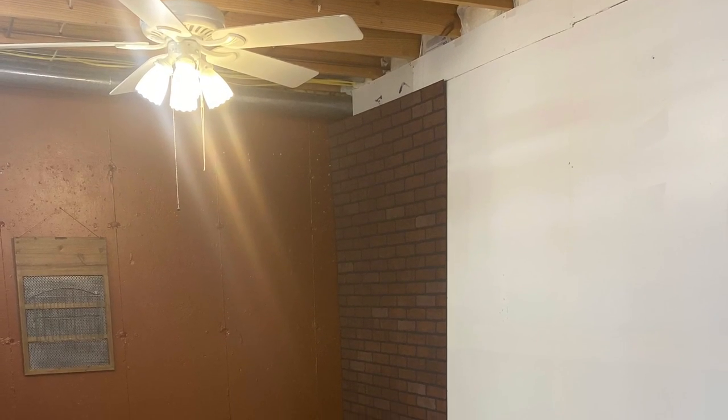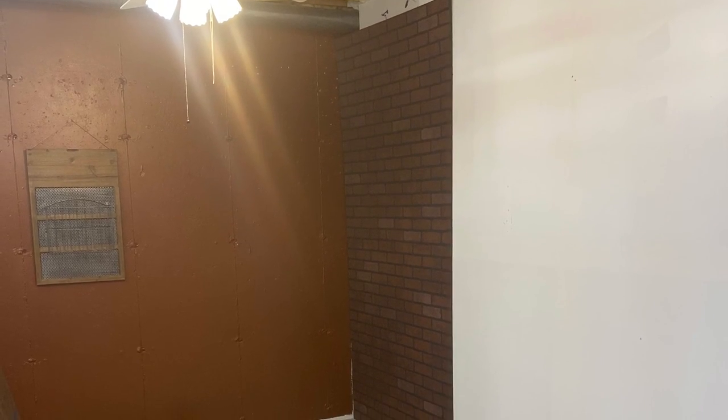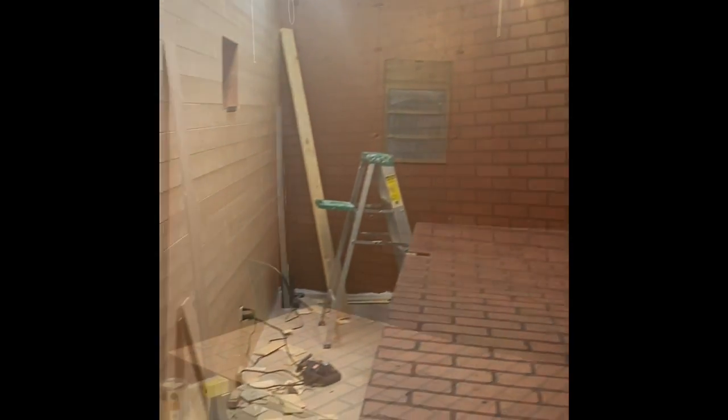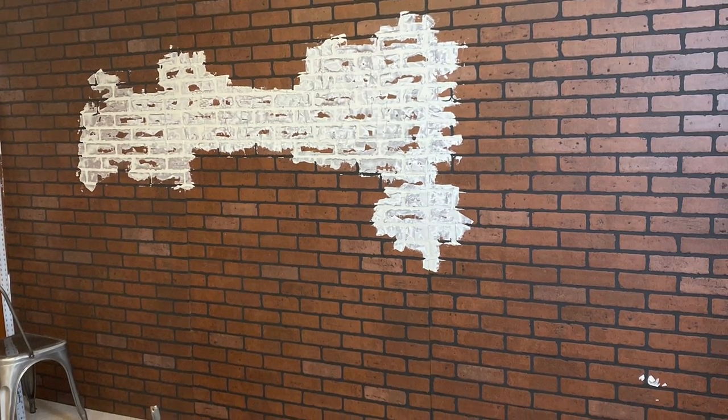What's really cool about the brick panels is they just cover so much space and go up so quickly. I adhered them to the wall with the finish nailer — make sure that you're hitting studs and they're secure. For the areas I had to cut around, I used a jigsaw. It is helpful if you take the brick sheets, flip them upside down, and cut on the back side so the jagged bricks don't throw you off.